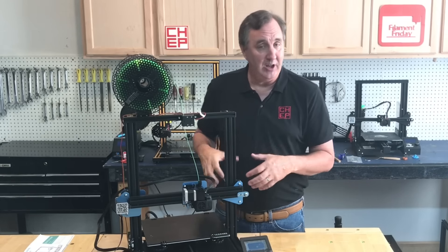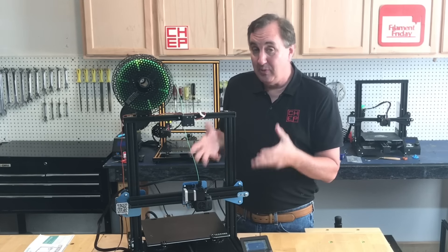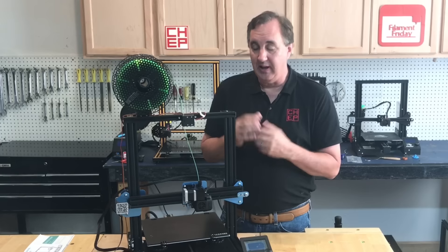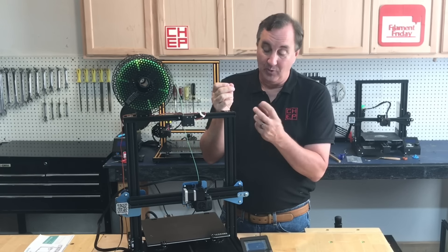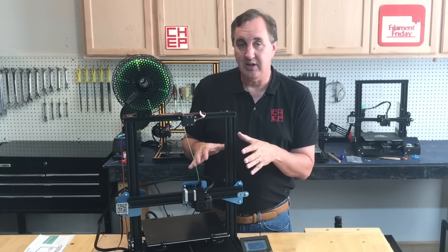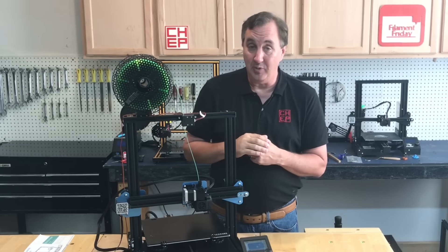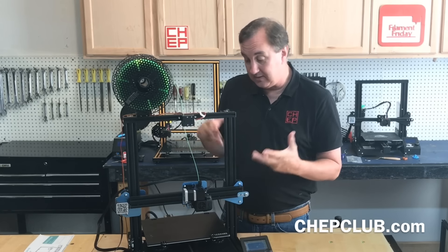Overall I think this is a very solid machine with a really nice build area and a lot of nice features for $299, including a bootloader so you can upgrade the firmware if you want to customize it further. It's a great machine to work from. I just don't like the hot end — I'm really disappointed in that piece-together design of an E3D-style heat sink with a Creality heat block. I would put an actual E3D V6 on it and fix that funneled plastic piece so it can print really flexible materials. Then I think you'd have a really good printer for still a relatively low cost. That's the one area I'd hope Sovol improves.